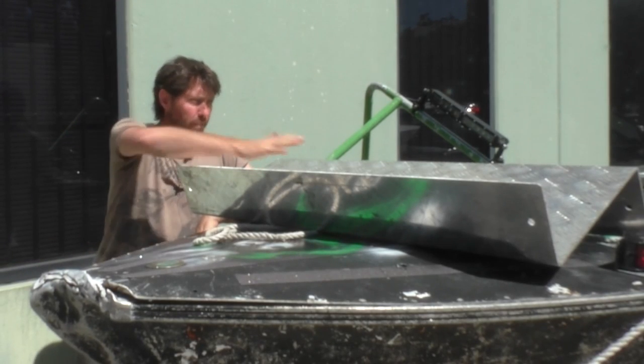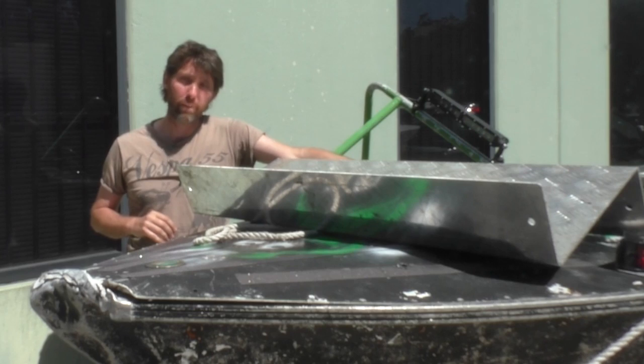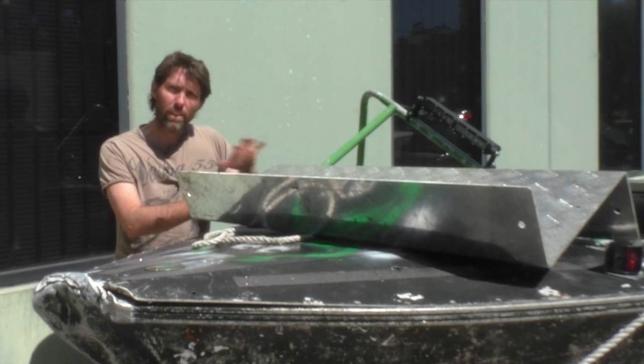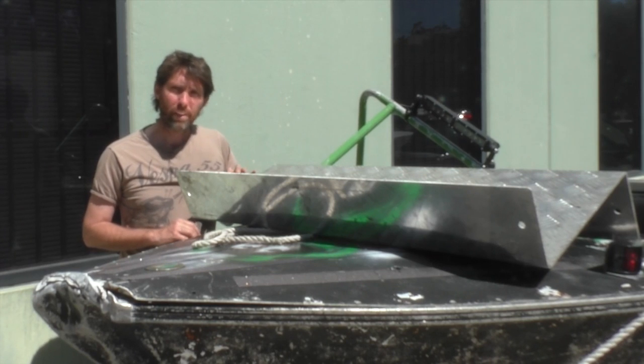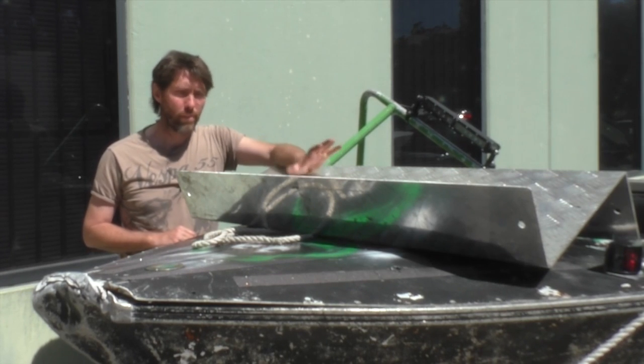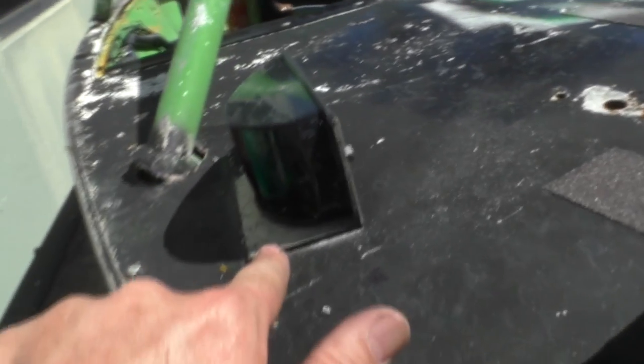My plan of attack is to build this front section - what I think originally on the chalkboard I had listed as the glove box - because it's going to be somewhere I can put things into from the front of the boat. There's no point fixing this grab rail, windscreen frame, whatever you want to call it, until it can be braced, and it can't be braced until this is in place. Because this glove box section is going to come up and across and down, my plan was always to take out these old angle brackets and attach the nav lights to the side of that box. When I lay this piece over, it's exactly the same width as the distance between these two brackets - so that's perfect, that's the distance I'm going to make it. I'm going to cut it straight down and use the full length across.